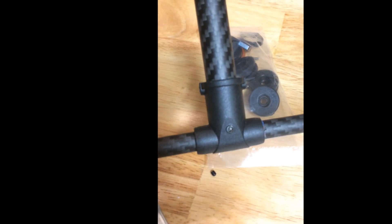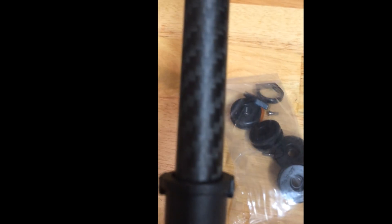Real quick - the landing gear grub screw that holds the actual skid centered: I already had one strip out, and it's buried in the plastic, I'll probably just leave it in there. It didn't even get tight enough before it stripped out, so I didn't bother putting the other one in. If you really want to secure it, I would get a regular hex screw with a head on it, a little bit oversized in length.